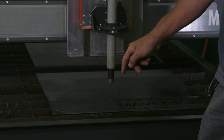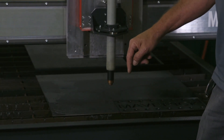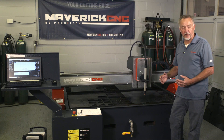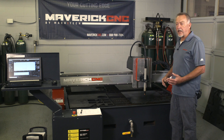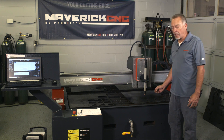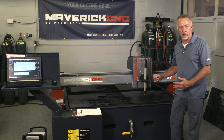As soon as the cut height is reached, then x and y motion starts and the machine starts cutting its part. As soon as it gets up to speed, another height control function called arc voltage control starts to take over. That's reading the feedback arc voltage between the electrode and the work piece while you're cutting, and that's what maintains real-time height with an integrated THC.